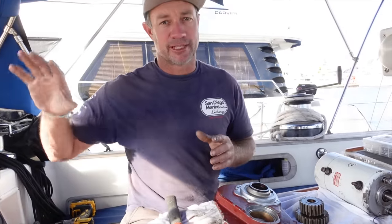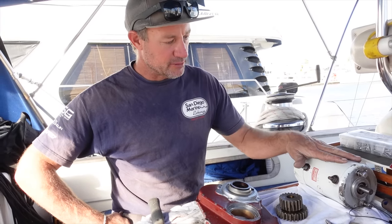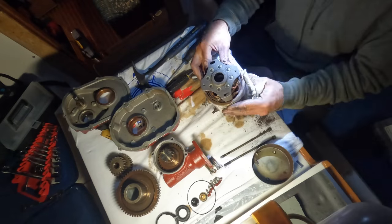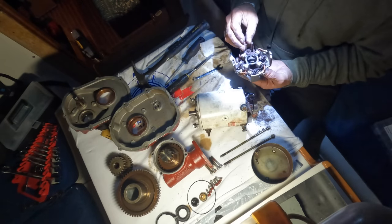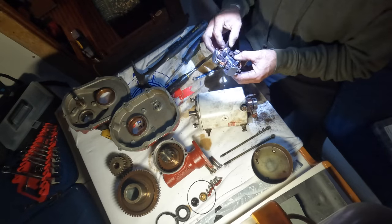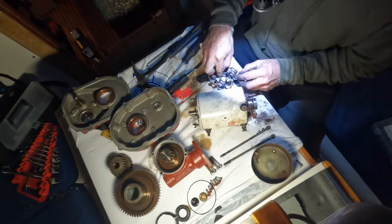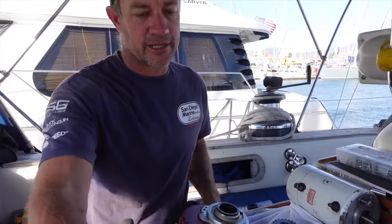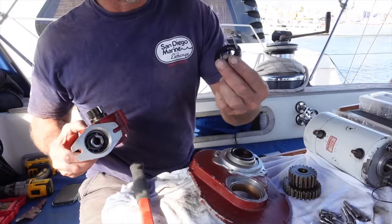It's the gearbox. I still haven't cleaned up all the parts up the front, all the main drive unit, the cogs and so on. I inspected this last night, which is our motor that attaches to the gearbox. At the back end here, the brushes, probably about 50% worn, so they'll be on the list to reorder. So if we do have a problem, inside everything looked all right. It has had a little bit of oil go in. Obviously, one of the seals in the worm drive here has let a little bit go.